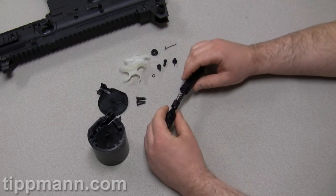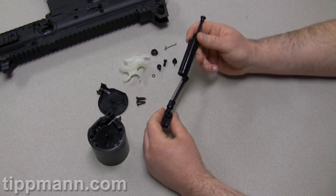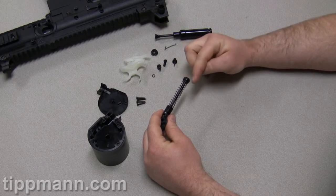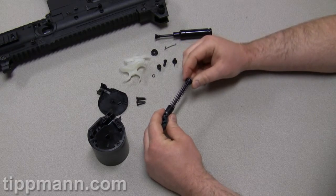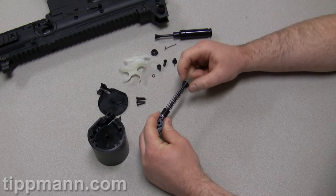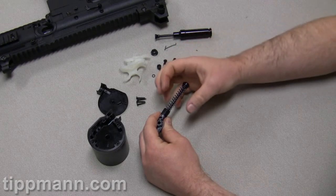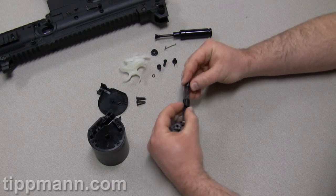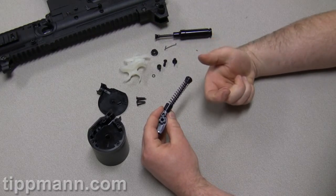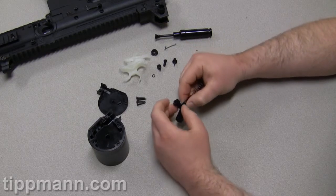Now you have your feeder ratchet assembly and the feeder axle. We'll go ahead and pull that out of the cylinder. We usually get a lot of people that will flip the U-cup seal around the opposite direction. What will happen is, if you have this flared end facing the direction of the feeder housing, you'll get air that will blow past it, and it will not engage the spring. So your Cyclone feed will not operate if your U-cup seal is flipped around backwards. Go ahead and remove our feeder axle.